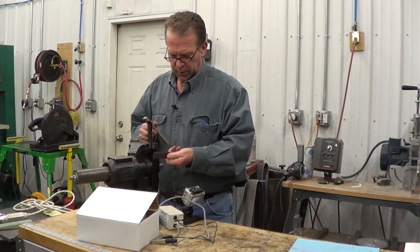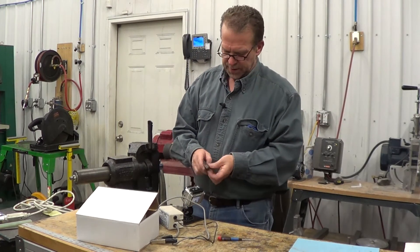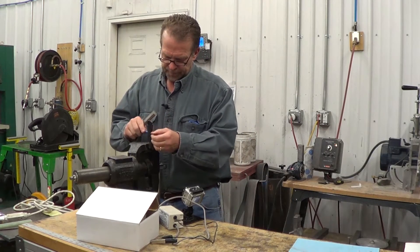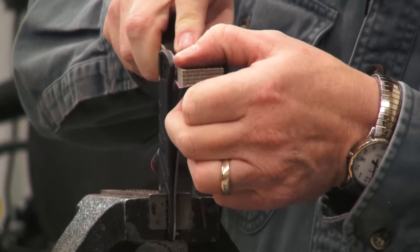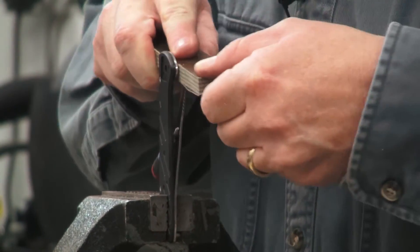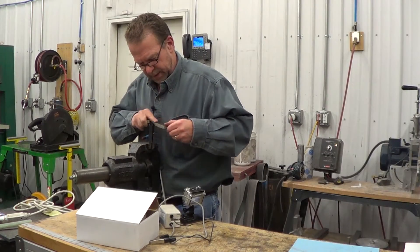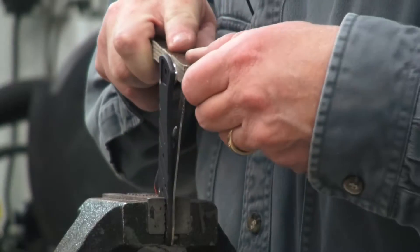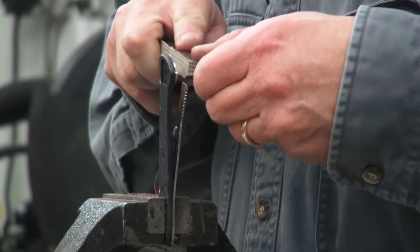I'm using a bit of shop roll — just a piece of abrasive — and I grabbed a scrap of G10 to use as a sanding block. Just wedge a little screwdriver in there to hold it open. You can't see it but you're removing metal each pass, and again we're talking half a thou at a time. And that's smoothed that face up.